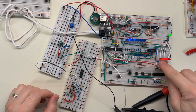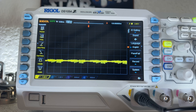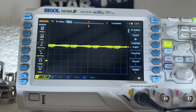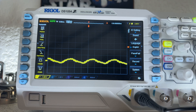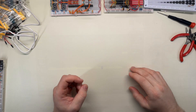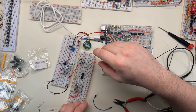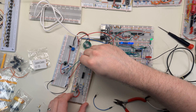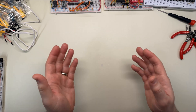But when I hooked the RAM output to the transistor, it wasn't turning the transistor on. Looking at the scope, the signal wasn't going up to five volts. When I disconnected it from the RAM chip and plugged it straight into 5V, the transistor turned on — so the output from the RAM chip just wasn't enough. I tried varying the resistor on the base of the transistor and even removed it entirely, but it didn't make much difference. It was really inconsistent — sometimes it would turn on, sometimes it wouldn't. I got pretty stuck here for a while.